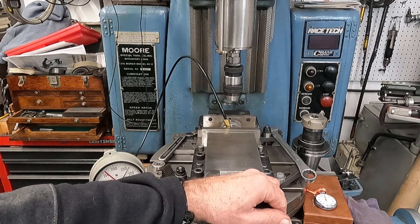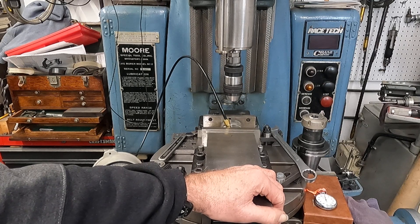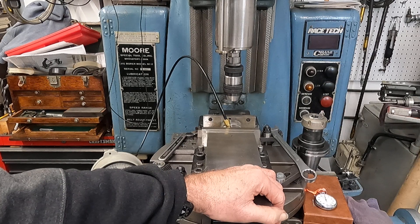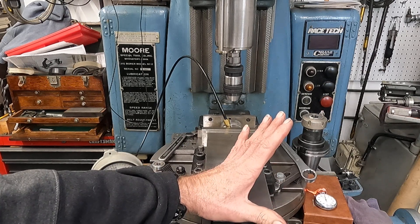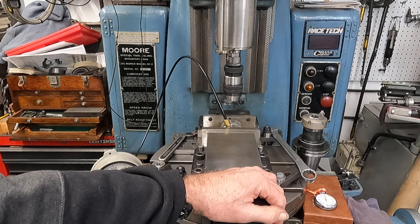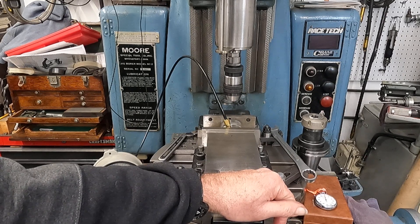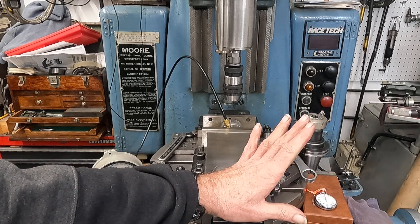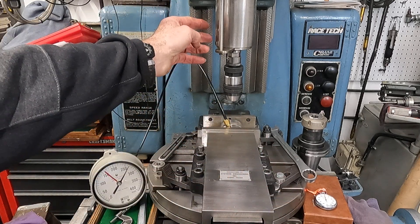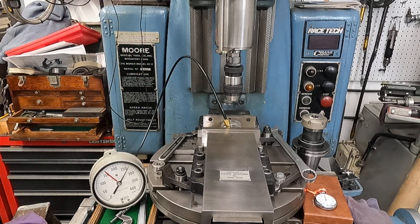If you need a bearing replacement, this Moore — if you've ever heard of custom preload bearings, this is the machine. This isn't a nonsense little deal like the Delta heavy-duty shaper with regular bearings just squished together; this is the real deal. You're taking really expensive bearings and doubling the factory heavy preload, which is about 125 pounds. The nose pair is 250 pounds preload, and I believe the tail pair is something like 146 pounds.